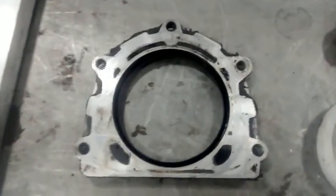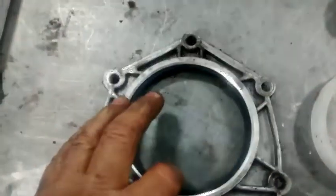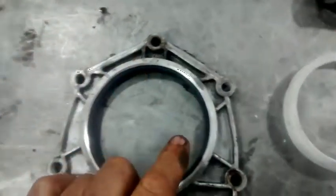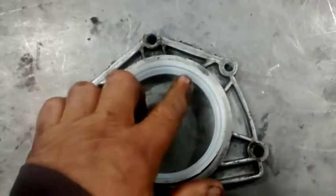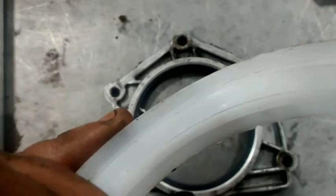I got covered in oil — it was kind of hysterical. Anyway, people say the seal is leaking. This is the seal — like I say, it's off a 300 TDI. The seal is Teflon, not rubber, and it's really good. You must put them in when assembled. When you get a new seal it comes with this assembly ring — this piece is stepped a little bit here so that goes over the crank, then the seal slips over and it's done. You must install these dry — never put any oil on these.